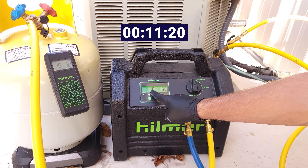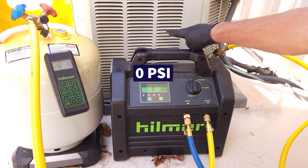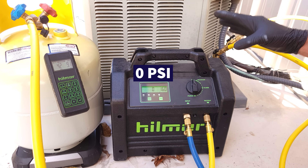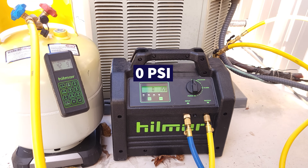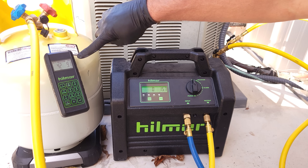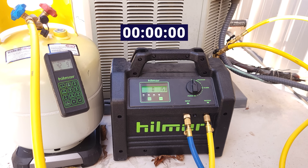Now we want to see if the pressure rises — we pulled this down to zero psi. If this unit had a leak, you would not want to pull it below zero psi, because you'll pull any air surrounding the unit or the leak spot into the system, then into the recovery machine and into the bottle, contaminating it. We've pulled it down to zero and we're waiting to see if the pressure rises. You'll also notice our scale was still increasing in weight while the recovery machine was reading zero psi — that's from the liquid refrigerant in the system vaporizing.